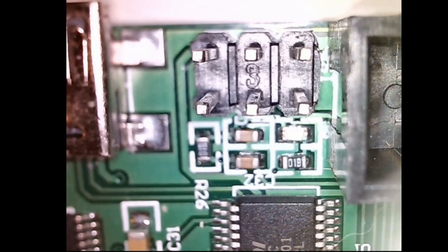Resume On Power Loss is notorious for killing SD cards. It's a marketing issue — how do we sell more printers? We tell people hey, we've got this feature where we can resume on power loss so they don't lose their print. It maybe works 20% or 30% of the time. That feature has since been rolled into the main fork of Marlin — Marlin 1.9 has it and I'm sure 2.0 has it as well. I choose not to turn it on because quite frankly I don't care. That's why we don't have bootloaders on some of these boards — there's just not enough memory.